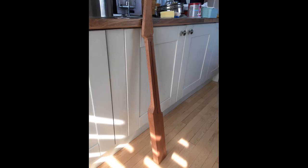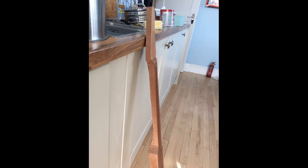I found a piece of Sapele in a local wood yard — about 2.2 meters long by 9 centimeters wide — and had in mind a neck-through design for this build. I've routed the truss rod channel and band-sawed off the back of the neck to remove a lot of material, probably leaving about 25 millimeters worth of material for the neck. I've shaped the headstock and also shaped the side profile for the headstock on the bandsaw.